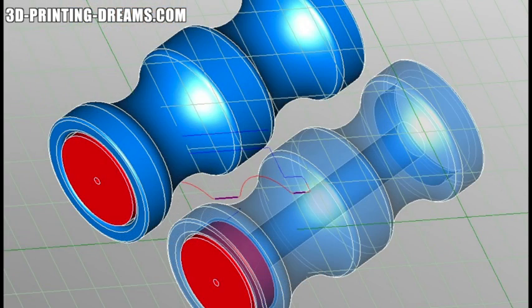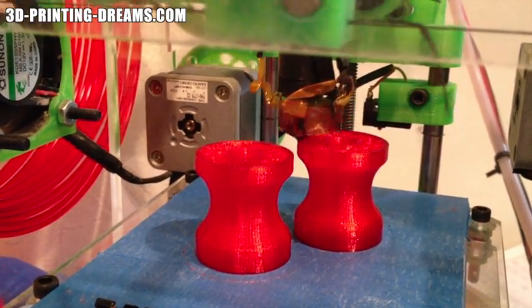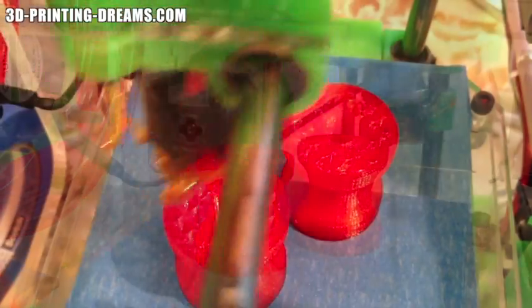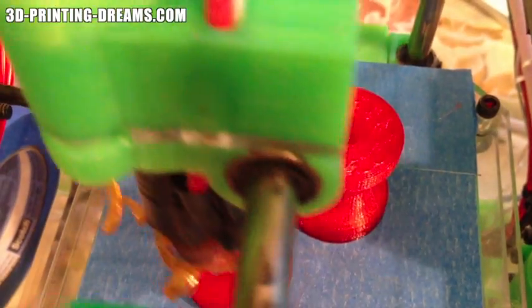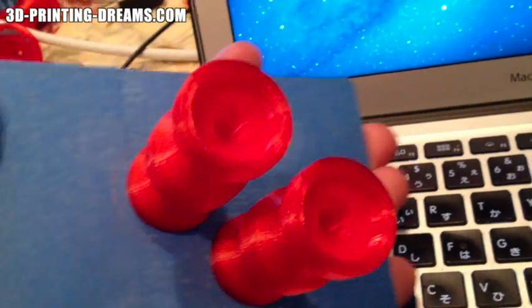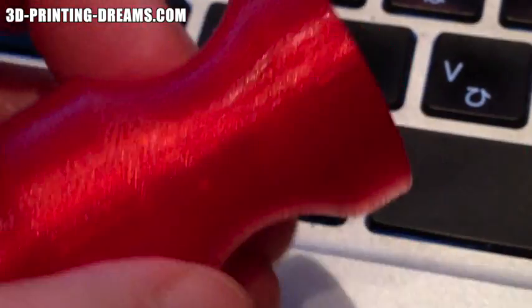Offsetting the rail dimensions, I created dual rollers for the dolly. To make it easier to print, I added small plugs to the bottom of each roller that could be popped out after printing. The rollers are printed in PLA with 100 micron layers. The mini bearings slide into cavities in the ends of each roller.